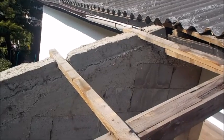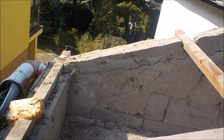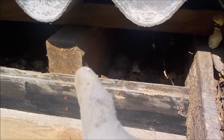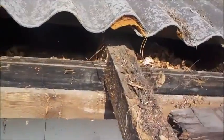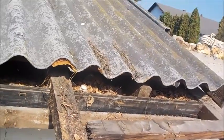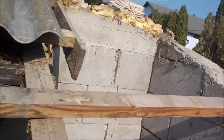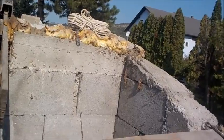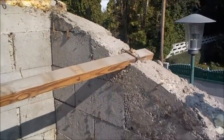Okay, so everything's got to come off, including this wall plate, and I've got to start again. I'm going to crack on with it, and I'm going to try to join up to the original spars, which is what he should have done. That's the original spars from the main roof there, look. He's just notched these into the fascia board and put a piece of wood underneath it to hold it up. That's how he's done that. Anyway, all this is coming out now. I'm going to put one on this end here, and the only way I can fix it is maybe screw a piece of wood to that wall there and rest it on there. So we'll do it that way. Anyway, I'm going to crack on and I'll show you how we are when we've got this done. I've got to make it watertight today.